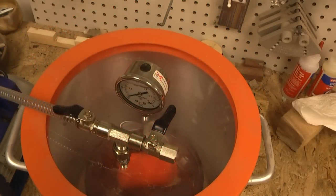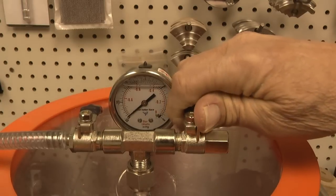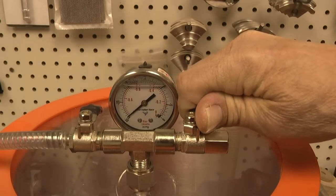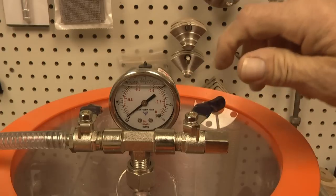We've been a bit over an hour and you can see there's pretty much no activity now, just an occasional bubble, so I'm going to go ahead and turn off the pump. At this point I still have a secure vacuum in here, and if I were to release the air immediately the liquid would go splattering over the entire container, so I'm going to let it out nice and slow.